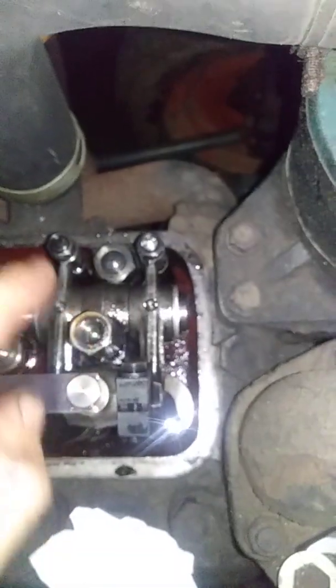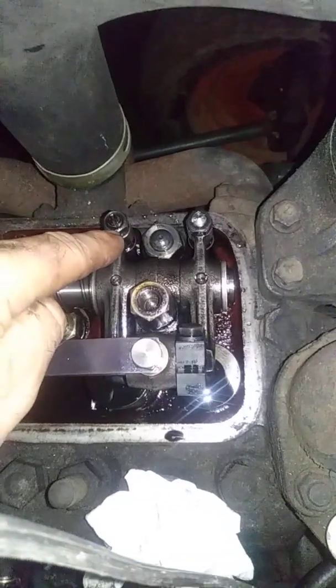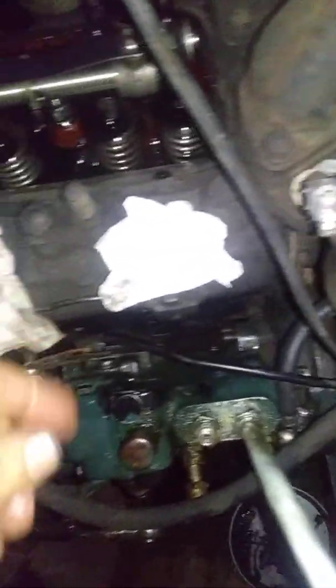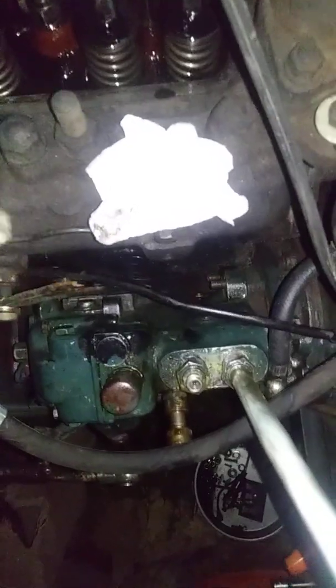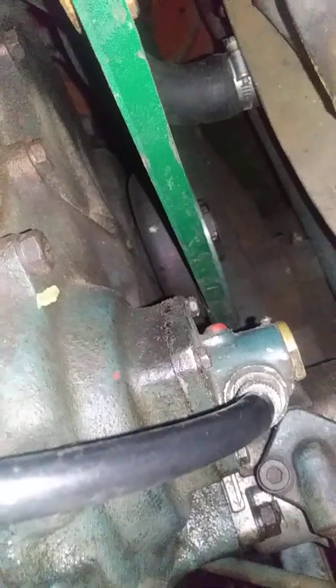The exhaust valves are on the outside and the intake valves are on the inner side, with the intake pipe and siamese exhaust manifold. I took the intake valve since I didn't want to bend an exhaust. I backed off the lash nut, cranked the intake valve down until it compressed the spring to make a piston stop. It's easy to roll the motor over by hand off the fan — careful not to snap the fins off. I rolled the motor over until I felt the piston touch the valve, put a mark right there where I could see it, made a pointer with a yellow paint mark for a good line of sight.